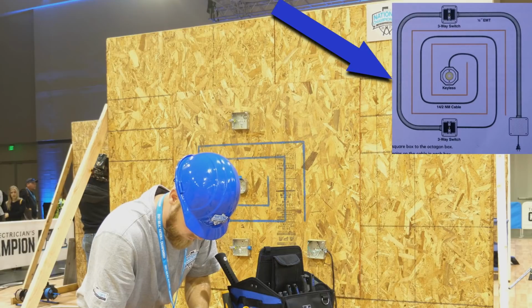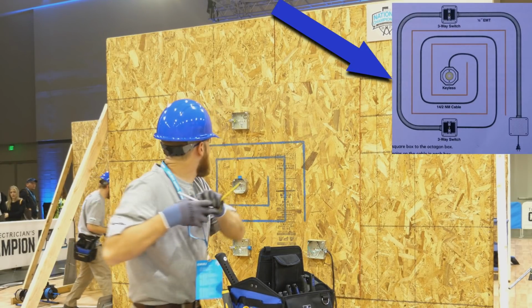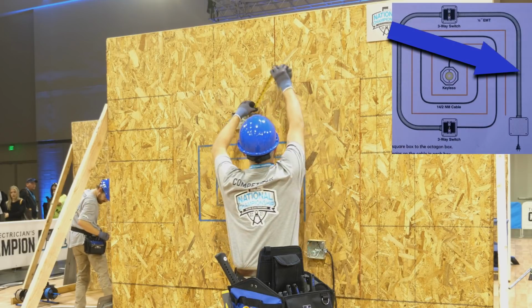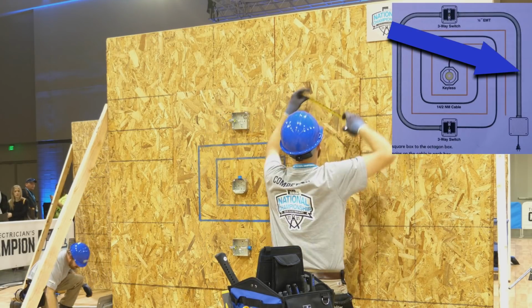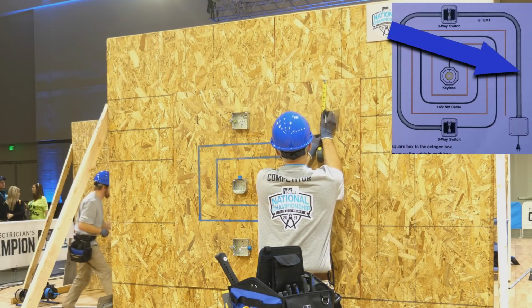So the EMT bend on the left is going to be back-to-back 90 with 2 box offsets, and the EMT bend on the right is a simple 90-degree stub. But this bend is also going to have box offsets on each end to go into the boxes.